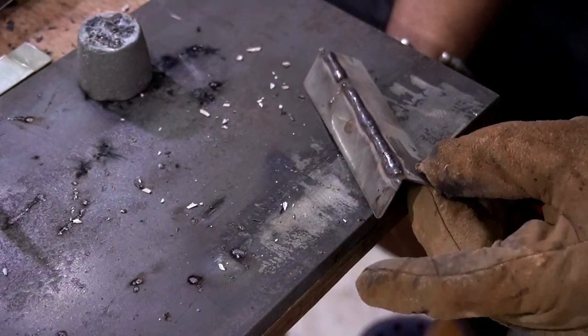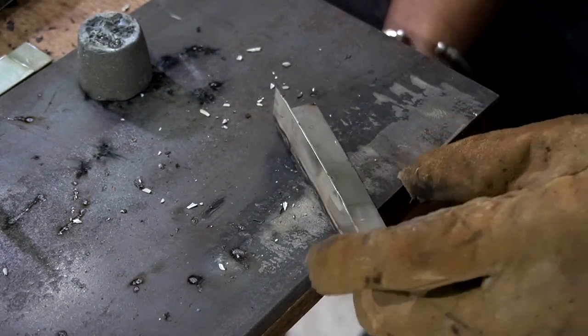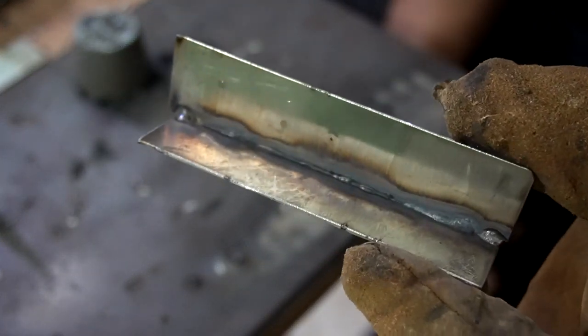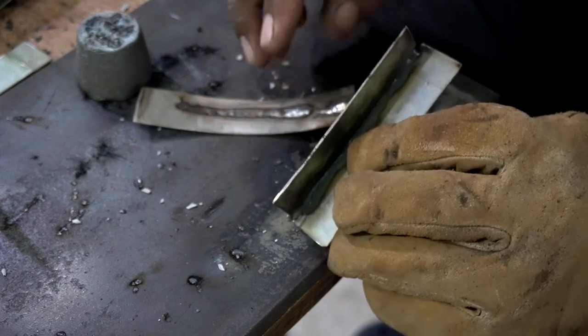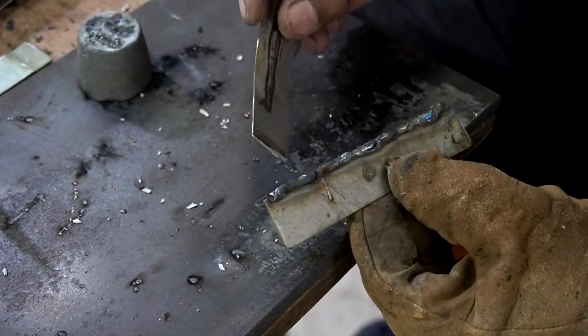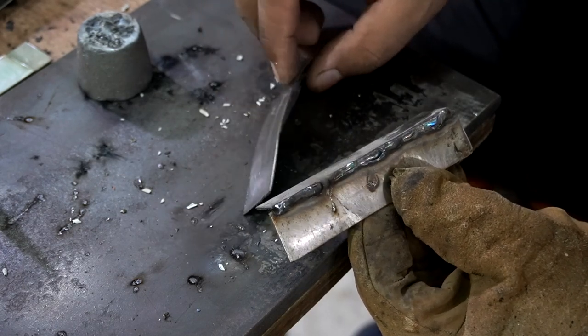So if you're considering the weld bead, it's not looking pretty, but there is good fusion between the two surfaces, and if you compare the warping, then in the angle the warping is almost negligible compared to a straight weld. Surely the technique is quite effective, but you need a lot of practice to do that.